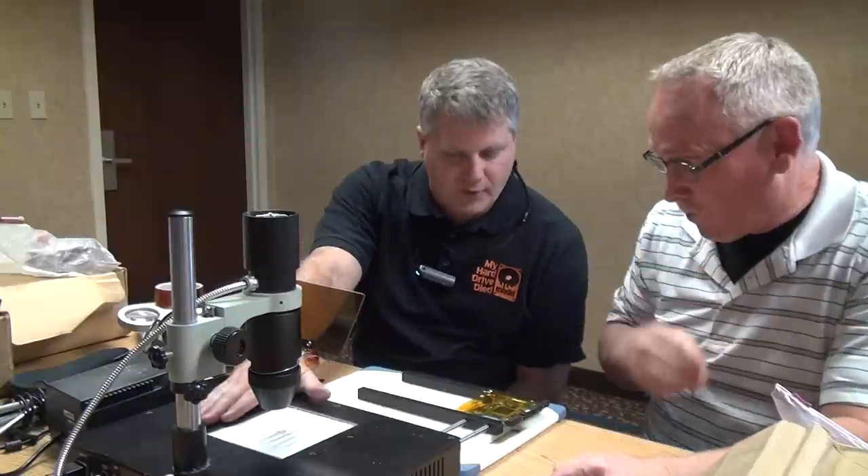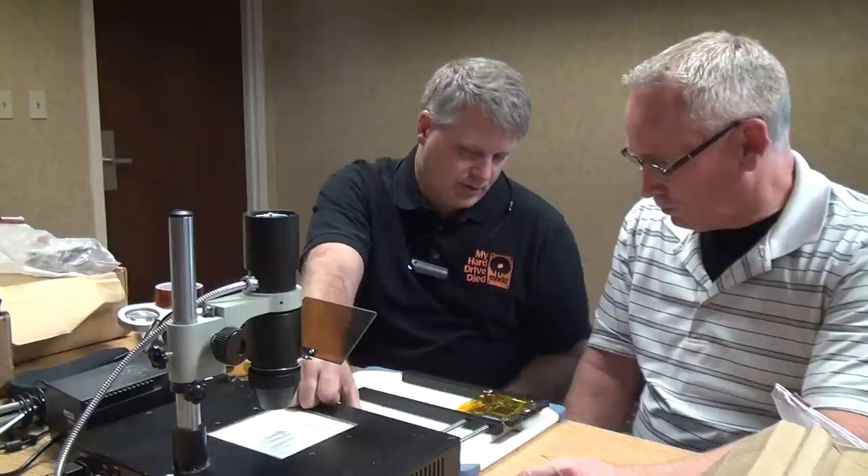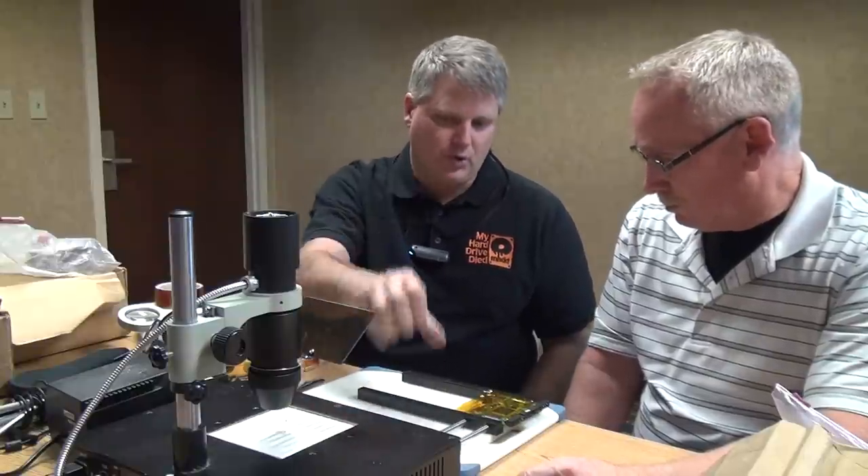When we put this up in the infrared tool, the center one controls the light. We're going to focus where that spot is. If it's below about 340°C, it'll actually pulse to try to raise the temperature so it doesn't hurt the chip. The ROMs are actually very robust chips — I can zap them for quite a while without them getting hurt. But if it was another chip like a CPU, it would crumble after this process and you'd have to lower the intensity down to like 240 or 250. I have it set at 350 so it doesn't pulse — it stays on and just frys the whole time.